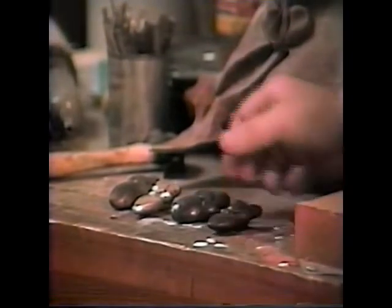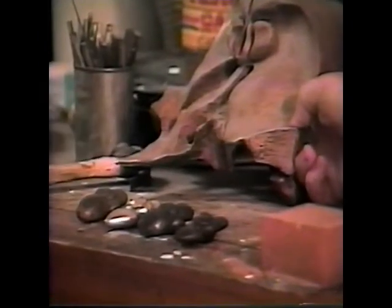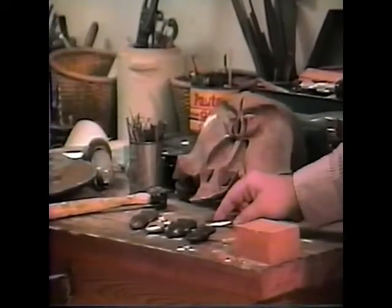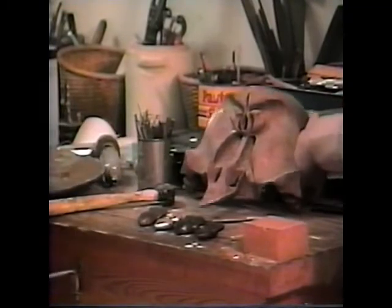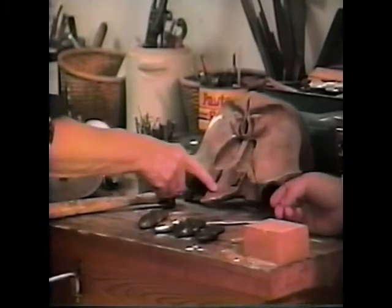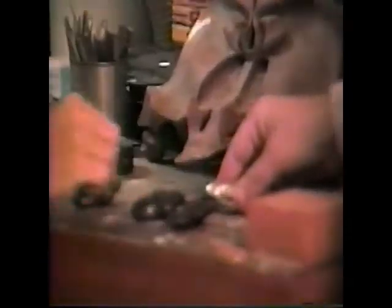These are bronze objects. This is more or less how it looks when you get it back — this has been sandblasted, and it has to be polished. This section has been polished. What do you use for that? Sandpaper or files. You can use files like that. The problem with using too many power tools is you eventually have to do it by hand anyway. But it does help taking off the gates. I'm taking it absolutely off and then I'm going to patina.